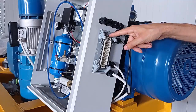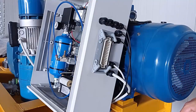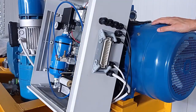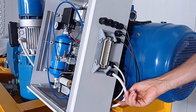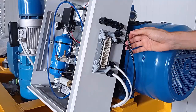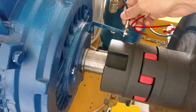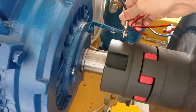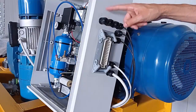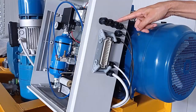Here on the side of the cabinet I have this connector for the cable that goes down in the tower with all the control signals, and the other cable going down the tower is the power cable going directly from the generator. Here I have the cable to the yaw motor, the cable to the yaw limit switch, and these three are proximity sensors — they will measure the RPM of the high-speed shaft, RPM of the low-speed shaft, and the status of the disc brake. And here I have a cable going to the cup anemometer, the wind vane, and eventually to a vibration sensor.